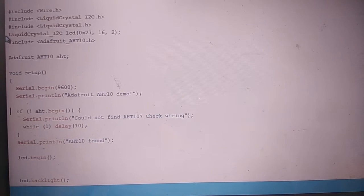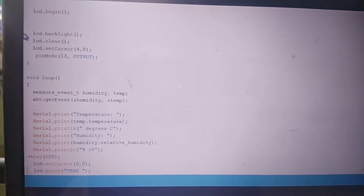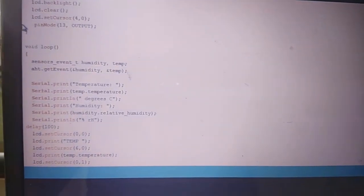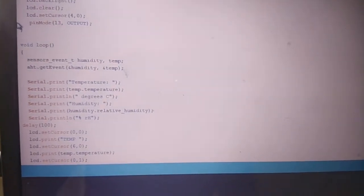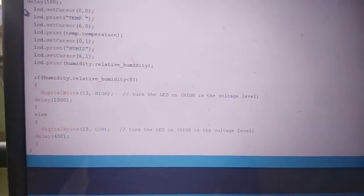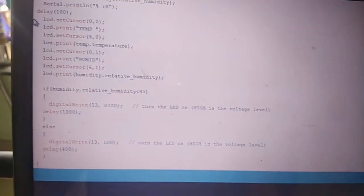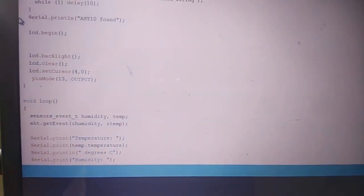In summary, the code calls the library, reads temperature and humidity via I2C, communicates with the display and sensor using I2C, displays the temperature and humidity on the LCD screen. If humidity is more than 85%, the relay switches off; if less than 85%, the relay switches on. You will find the code with screenshots at the end of the video.